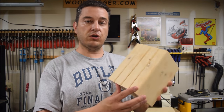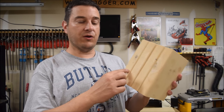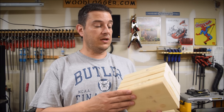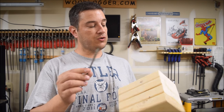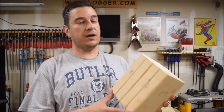I've got my block of wood all glued up now. While I was waiting for that to dry, I went ahead and drew a grid of lines across my boards. I'm going to space the holes about an inch apart. The plan says it's safe for the bees to space them three quarters to an inch apart. Because different solitary bees like different size holes — specifically mason and leaf cutter bees prefer quarter inch and five sixteenths inch — I've got a couple of spade bits. The holes will be just a smidgen over four inches in depth.